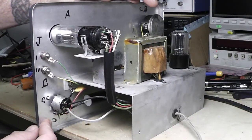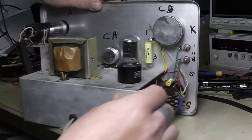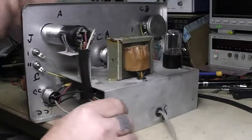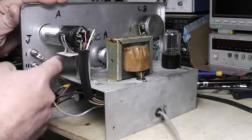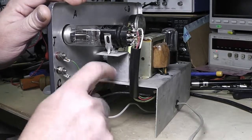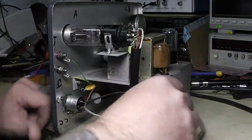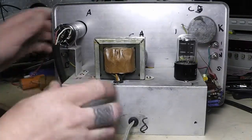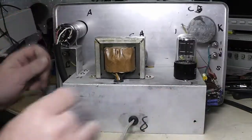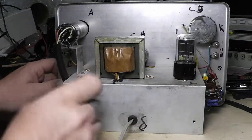This one is isolated everywhere, so this one wouldn't matter. But sometimes your equipment will have a piece like this mounting to another piece. You can see where this bracket's coming down in here, holding the magic eye tube in place with screws. So it's a good idea to go in and make sure these are really good and tight. Double-check them — I already did that.